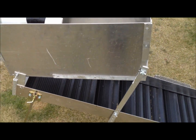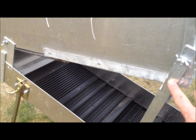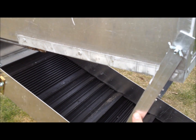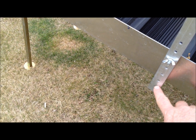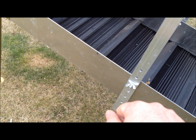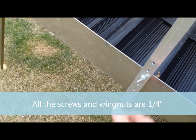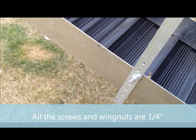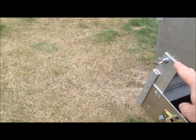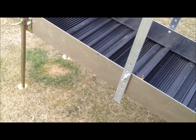I made these legs out of one-inch flat aluminum. I put locking nuts on here so they stay tight, and then just a series of holes. I clamped them down on a jig and used a one-quarter inch drill. All my screws — everything — are the same size, and that's really important. So whenever I need a screw for up here or back here, the wing nuts and bolts are all the same size.